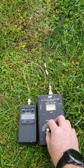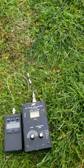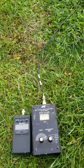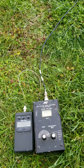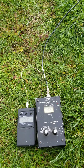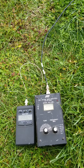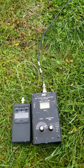From there it goes up, which is kind of odd to me, because I think the elements are a little bit long — so it should be resonant lower. This is kind of what I ran into before, and I ended up cutting it and making it totally out of whack. So I'm really hesitant to cut it anymore. It's definitely very usable, I just don't know why I'm not able to get this one to resonate as low as the first one I made. I just don't really understand it.